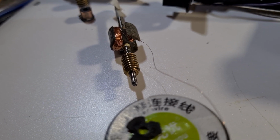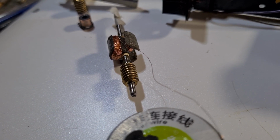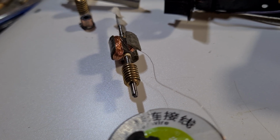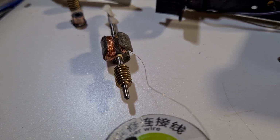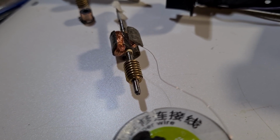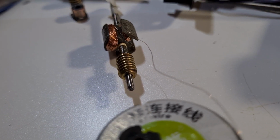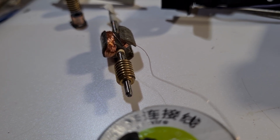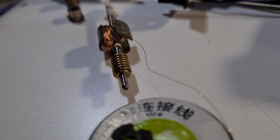They are sharp because when you pull out the original wire, the original coating looked like shellac. It just is so dry, it flakes off, so it's no use to you. So just give it a really good clean. Also make sure that you test that there is no continuity between the actual axle and the poles. So there's a plastic diaphragm tube that runs up the middle of that, which prevents it from having contact with the axle. If you have got contact, well then that's another problem.